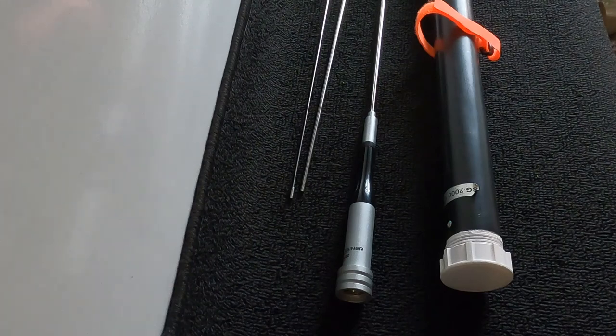Once the antenna has been disassembled, it can be stored in a homemade portable storage tube. All parts can be purchased off the shelf at your local DIY store. The antenna can be stored in a tube which is no more than 700mm in length. The storage tube is made from 40mm PVC waste pipe.